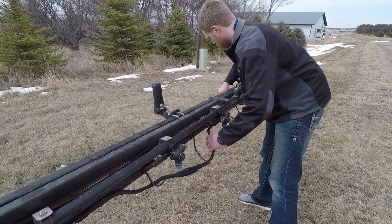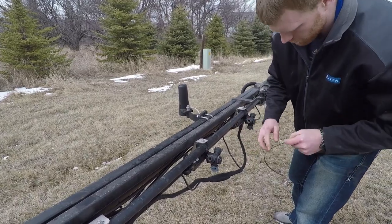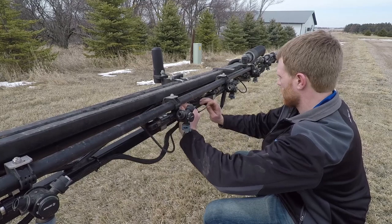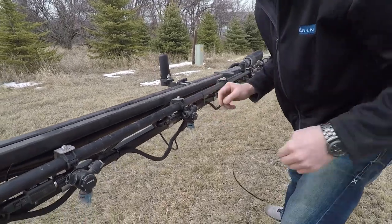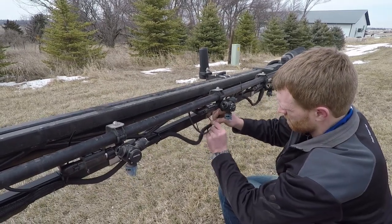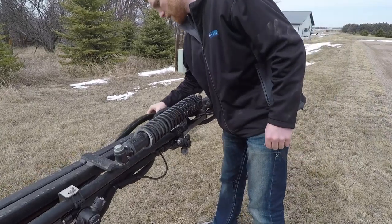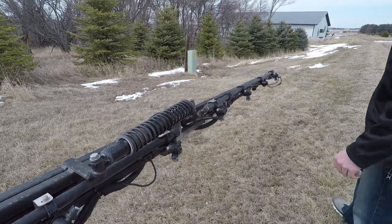Further down here, that's how we don't want it - cables drooping down with a big loop on that cable. We don't want to see that cable moving back and forth, continuously wearing and tearing on that nozzle. It's going to wear those pins out, those connectors, and eventually pull out the wires. They could also potentially catch on other parts of the boom when you're folding and unfolding - those booms tip back and the cable might droop down and catch on an angle bracket or another nozzle and tear that nozzle off or rip the cable off.